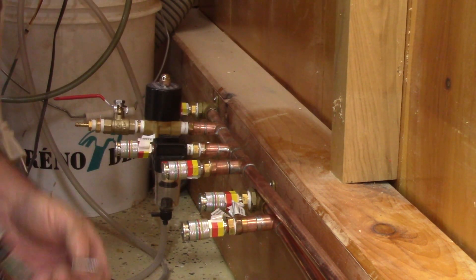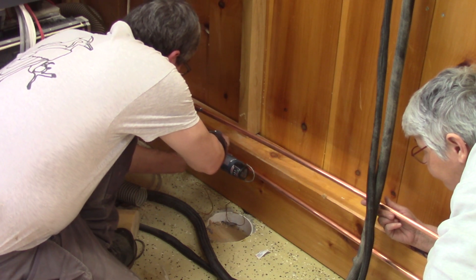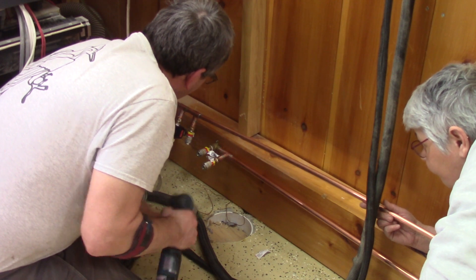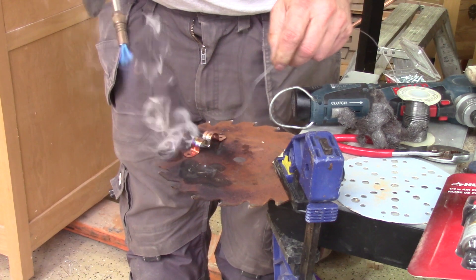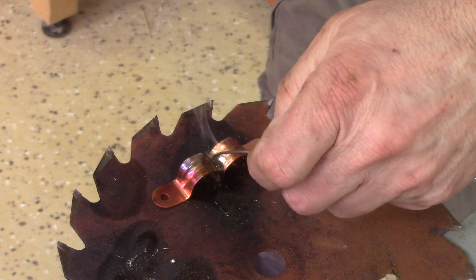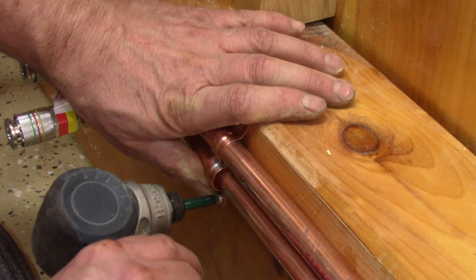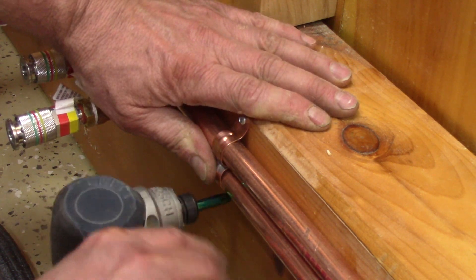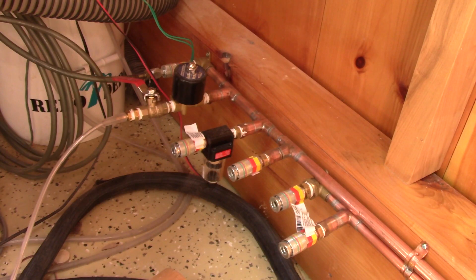This means that I can screw the pipes to the wall. The 90-degree elbows at the end are quite easy because they already have screw holes in the elbow. For the rest, I need to make my own holding brackets. Now it's quite easy to screw this to the wall. And now with all those air couplers, I have a dedicated output for the CNC and another one for the air assist.